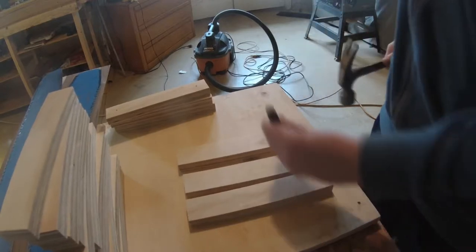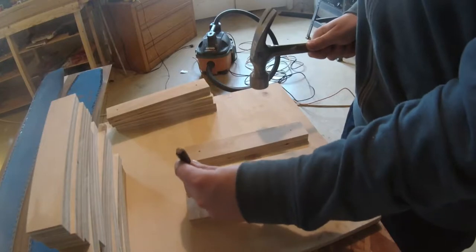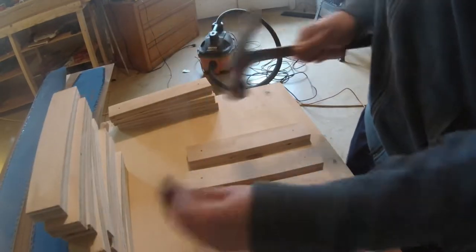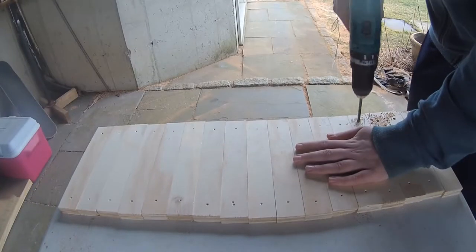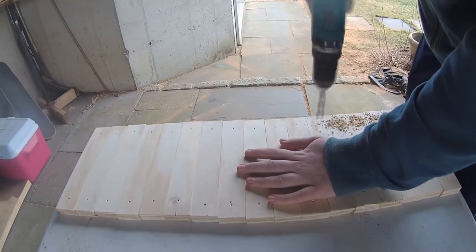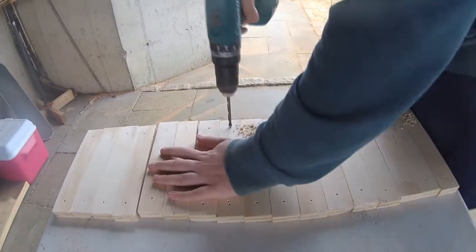As you can see here, I have a piece with a knot in it and I throw that to the side — I cut extra pieces because you don't want knots, as those sections of the wood are weak points. Once you've center punched all your holes it's really easy to take a quarter-inch drill bit, or whatever size threaded rod you're using, and drill out the holes.